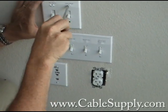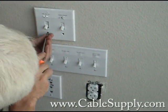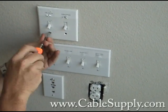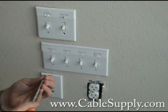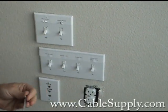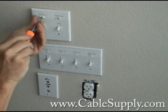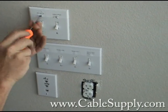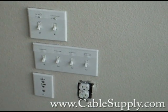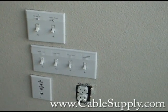So they were cutting the cat5 and running cable over here to switch one of the leads off of the cat5? Yes. Well, that's most likely why it didn't work because you've got to keep the twist as long as you can. The problem is that if you do it wrong, it will work but it will really slow down your network. They probably had a super slow network and couldn't figure out why. It probably couldn't do 100 megabits so it would default back to 10 — or worse, it may have just been repeating and retransmitting packets over and over again because of the poor cabling.